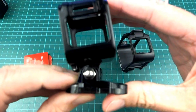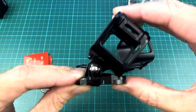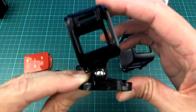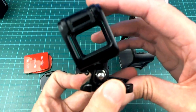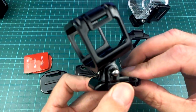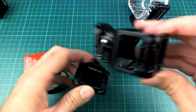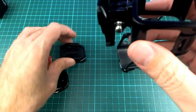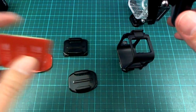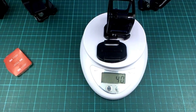From the point of view of mounting on a quadcopter, this is the maximum up tilt you can give it — looks like about 40 degrees, not quite 45. You can also tilt it down, which you might want if you had this on a large quad flying slowly for aerial videography. It tightens up quite nice and snug, and the whole thing when stuck into its mount is very, very solid. I think I will try this on my mini quad. It's just a matter of how much you trust this sticky tape. An important point is the weight — it's about 40 grams with one of these mounts.